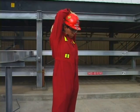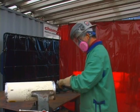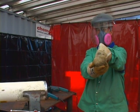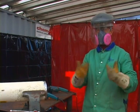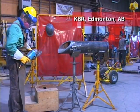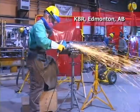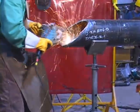As the handling of a grinder demands physical effort, a worker should stretch and loosen up before commencing the job. Micro breaks should be taken throughout the job task to promote circulation, prevent cramping, and to keep your body in balance. Always assess the job task to determine correct posture and positioning for your body. Do not reach, overextend, or twist. Metal or wooden step-ups and portable pedestals are of immense value. Always keep the work in front of you at a comfortable distance with good footing.